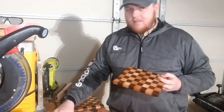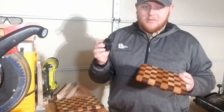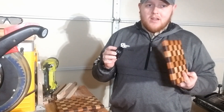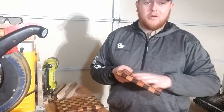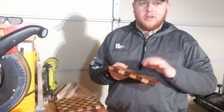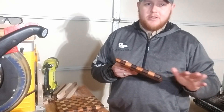So once again, this board butter works great. Usually you need one coat. If you need another coat, no worries — you can always reapply, just follow the steps. On following coats, you don't need to put as much because it's already finished and you're just filling in the gaps. If it's been used and cut up, you're just re-finishing it.